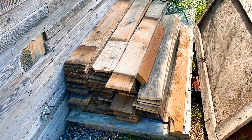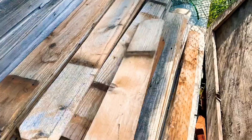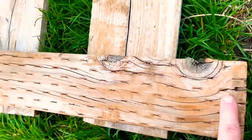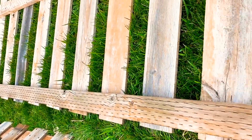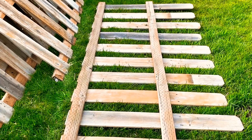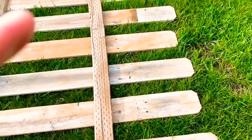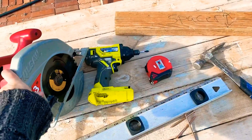To make a wooden fence you need your slats that are going to go up. Along with your slats you're going to need two boards that will be the rails to nail the slats to. They need to be the same size — whatever size you choose is up to you, but they need to be the exact same size. I've chosen to use a 2x4 here, but I also have some fence panels made from 2x6s.